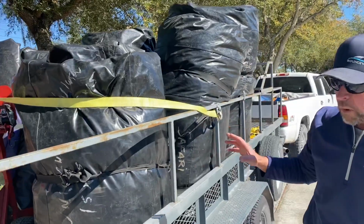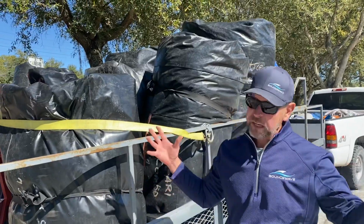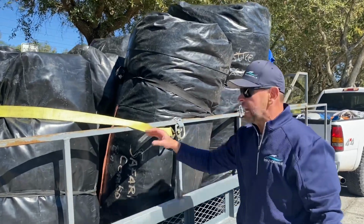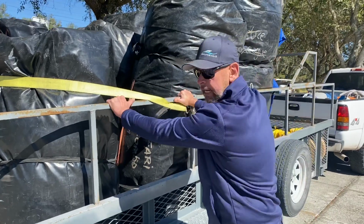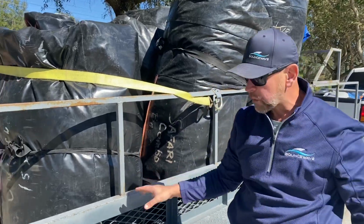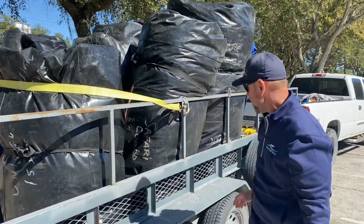And what happens with your welds, and when you want to watch your welds quite often, because here's what happens, guys. When you go down dirt roads, especially if you're in the Southeast, and you got these units leaning against this, these welds, this trailer is constantly shaking now. It's the dirt roads and the rhythmic movement of the trailer is going to constantly be putting pressure on these welds. So you always want to walk around and just check your spot welds. And you're going to find over a period of time that you'll see cracks in it in different areas.